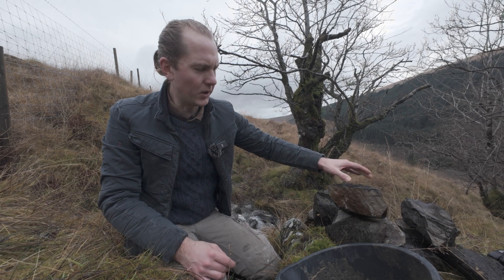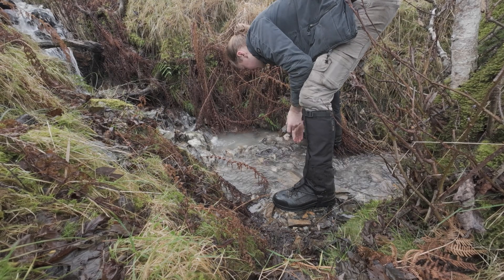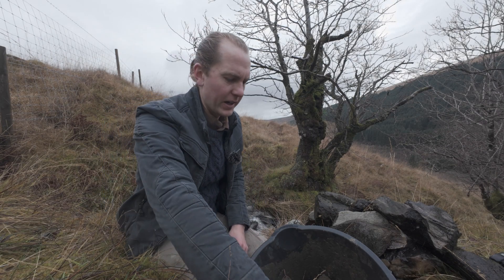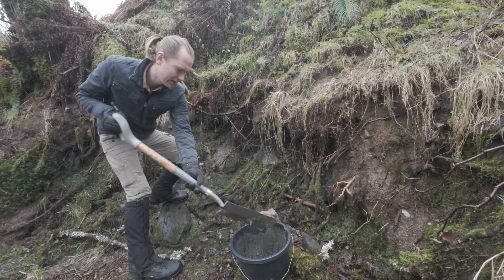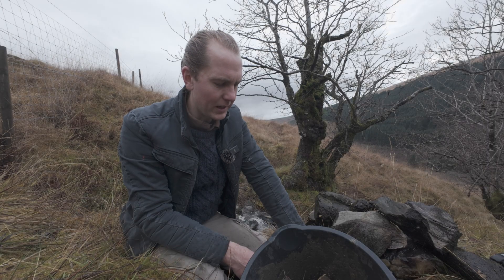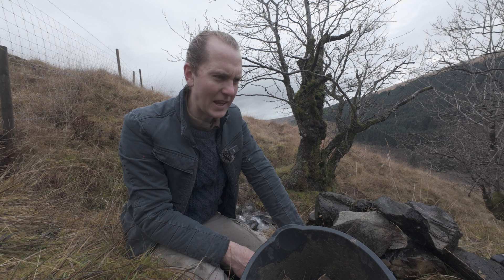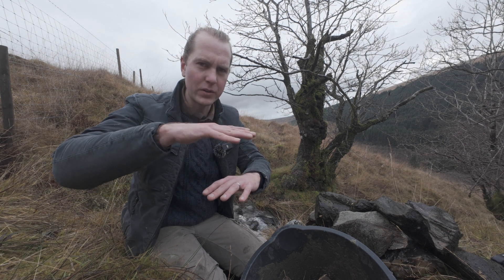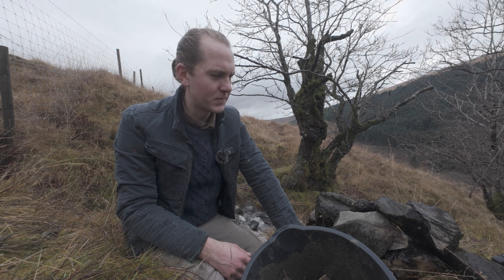I've gathered some more stones to put on top of that, and I really don't want to be using concrete — that's the best way to make a dam from the perspective of how it performs, but I don't want to get into that. What I did think though is I dug a load of clay from down by the river, lugged it up here, and it's my plan to wedge those in the holes in the dam. The reason I want to do that is just so that the available flow is used up by the hydro rather than spilling underneath the dam, and then the extra water flows over the top. It just feels like that's a better way of controlling it rather than having all the water leaking at the bottom where the top of the intake doesn't get the water covering it as much. I'm sure I'm gonna have to revisit it, but for now it should work a bit better than it has done.